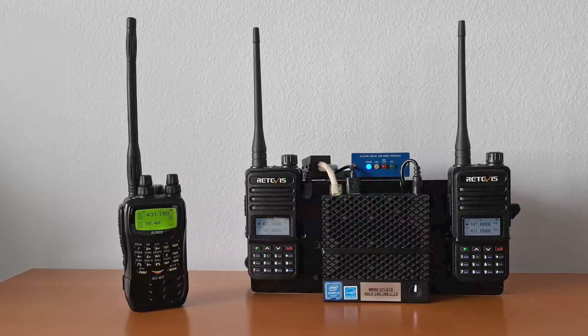The URI-101 is the first USB radio interface available that provides automatic COS plus CTCSS detection along with standard K1 2.5 and 3.5 mm jacks, enabling HTs to be connected and nodes to be built with standard inexpensive off-the-shelf cables and components, with no modifications or custom firmware required.